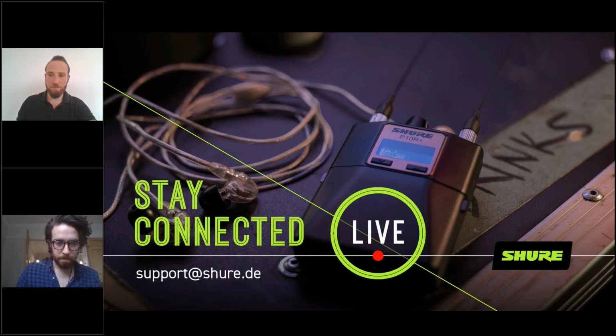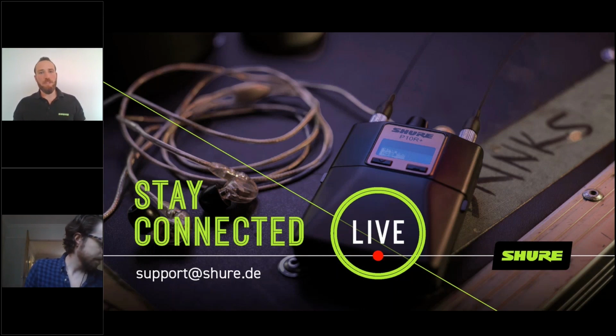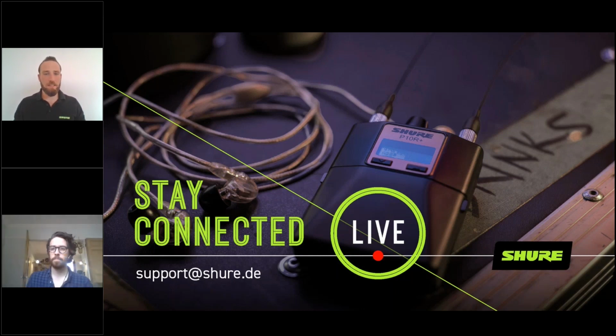So never active. Just as an extra bit onto that question, could you talk about what antennas you would recommend to use with in-ear monitoring systems from our portfolio? Very good question. Thank you very much. What you can use is fins such as the PA805, which can be used as a directional antenna on stage, or you can use helical antennas such as the HA8089 or 8091 or 92. I'm not sure about that.